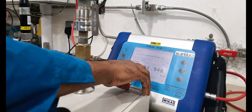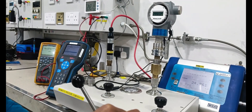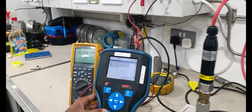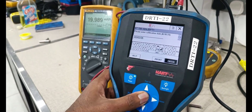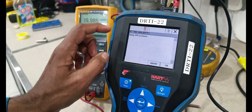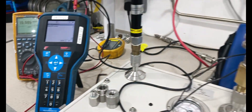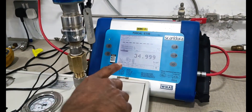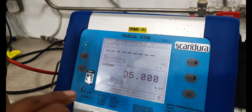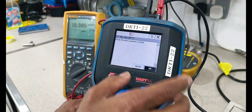One such is 35 bar — now showing 34.95 bar. Upper sensor trim — okay, moving to okay. Date/time 13:40 — applied for upper sensor value, pressure upper pressure value is 35 bar. Now 35 bar reached — applied, okay.